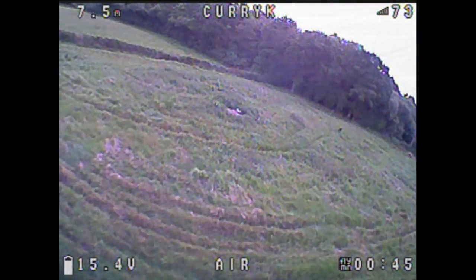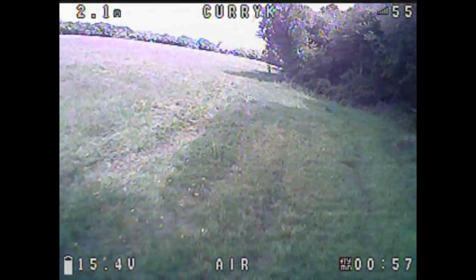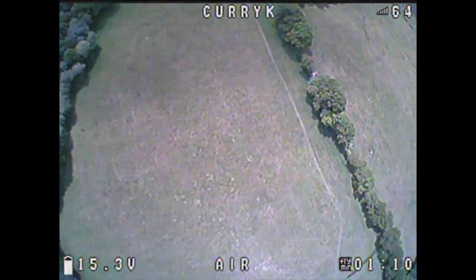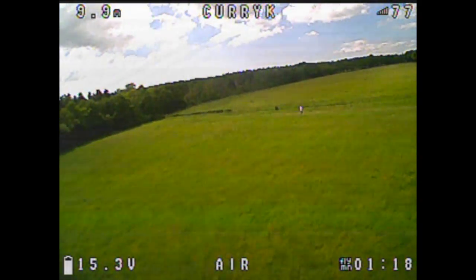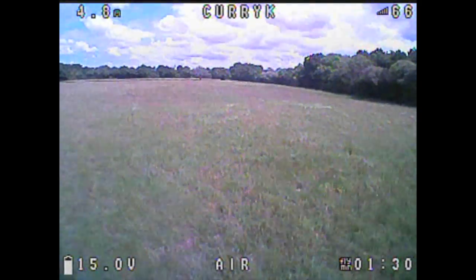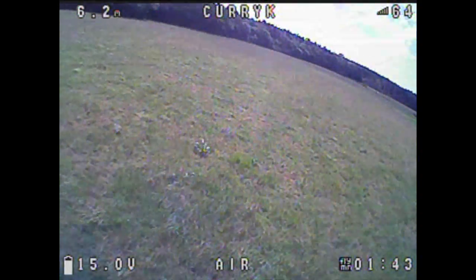The difference between an F3 and F4 is the amount of CPU used. My old F3 board without built-in OSD or barometer was running at about 15% CPU usage; this one, with all the extra stuff, runs at about 4% CPU usage - ridiculously powerful and can handle anything you throw at it. This board also has a built-in barometer which I didn't notice at first - I added it to the OSD and it updates incredibly fast. But on 200-size race quads it's a bit of a novelty - you can see your 0-to-100-metre time, but it's not really something I use.